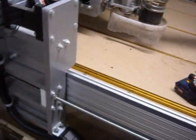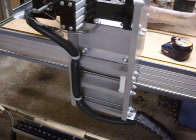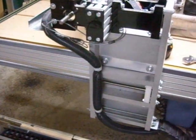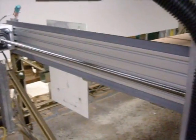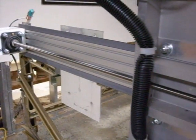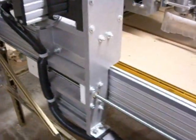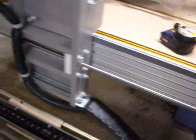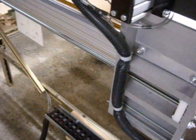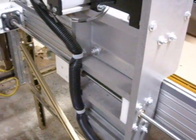Now we're going to play with the Y's — coming forward and coming back. Coming forward is not a problem; it actually doesn't even whip at all. It's always that return. And that is one hell of a whip on that lead screw. Something I do not like, because it'll resonate right through the router head. Like an earthquake.